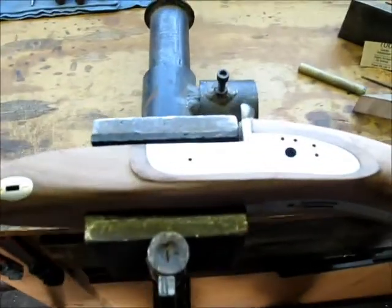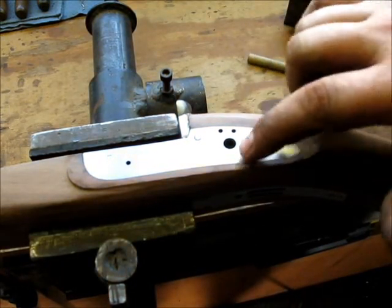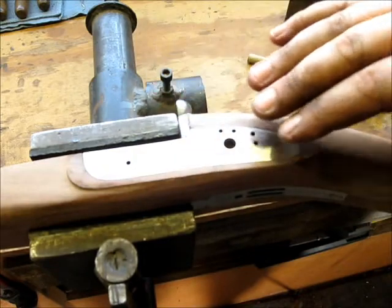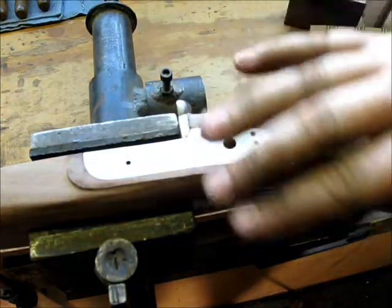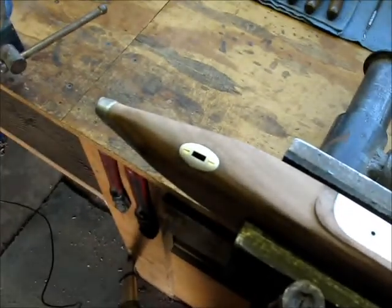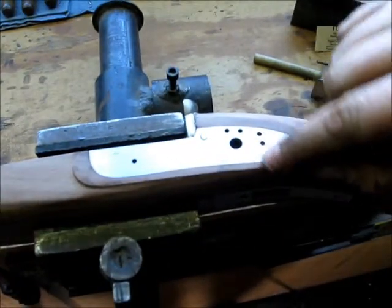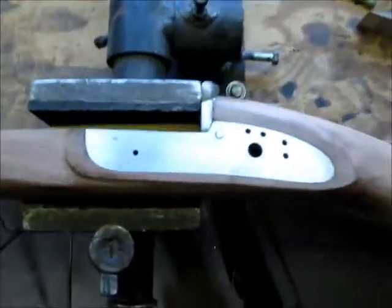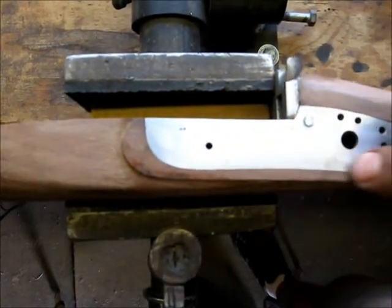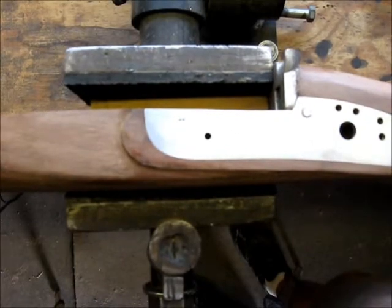Since I am working wood and metal together, the wood cuts a lot faster than the metal does, so you want to be real careful in these areas that you don't take the wood down below the surface of the metal. You want to take real light passes to clean up the metal to its 360 without taking the wood down below the surface. Sanding them in place with everything assembled allows it all to come down to a real smooth finish where wood and metal come together virtually seamlessly. A good inletting job and a proper sanding job will leave you a basically seamless, real close, tight fit.